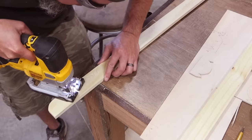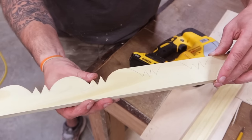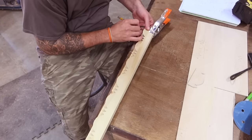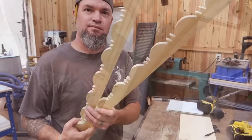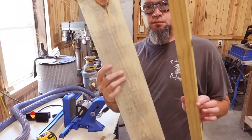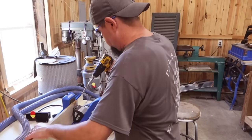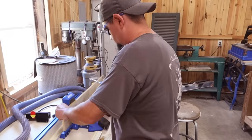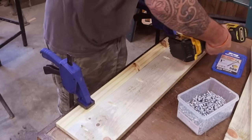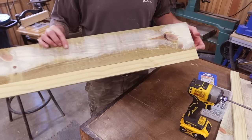Back to the jigsaw. This is the profile from the opposite view — now it's starting to look a lot nicer. Once you have your first board cut, since we need two of these, just put it on top of your second and trace the whole thing out. Now we have both of our gingerbread pieces. Now let's make our roof boards — I'm going to be using boards O and P. Instead of buying a wider board, I'm still using fence pickets. I'll join these two boards together with pocket holes — it's not going to matter anyway because this is all getting covered with shingles. We've taken super cheap fence picket material and made a six and three quarter inch board.